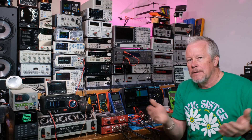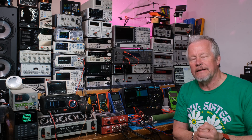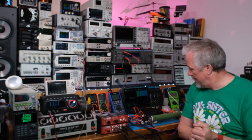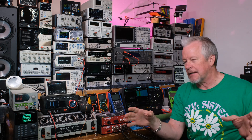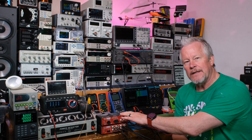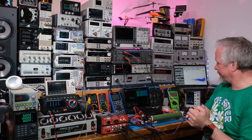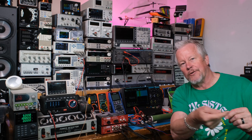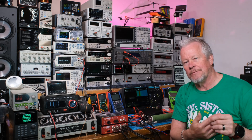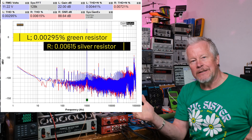Even speakers from the same manufacturer off the same production line will test a little different. When we're testing amps and want to baseline and spec them, we need everything to be clean. In the next video, we'll test the programmable load and see if it matches my best resistor. You wouldn't think a big wound resistor would be non-inductive, but they wind it one direction and then wind it back the other direction — the inductance cancels out. Pretty cool. Even the distortion is better with the green resistor.